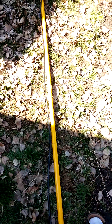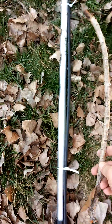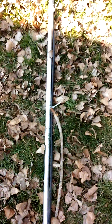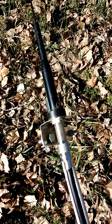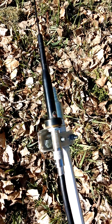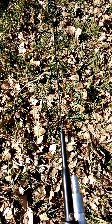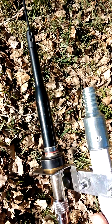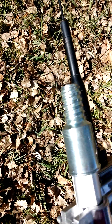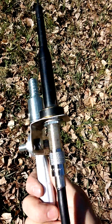So, painter's pole with the antenna on the top. Used a stick to measure basically the width between the zip ties all the way up. Standard CB radio mount with ham radio mounts — SO239 connector and my SBB5 Comet antenna. Very simple, just kind of nut and bolted it together.